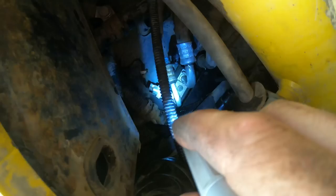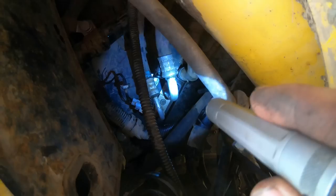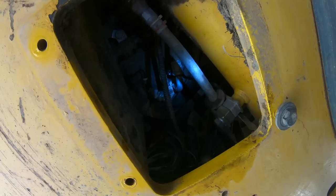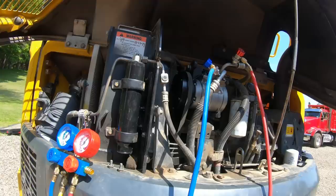That's the evaporator up in there — there are two lines and it's got an electronic going to it, one line for reading. That's probably why my AC kept shutting off and throwing a warning signal, which is actually good — Komatsu built that in so you don't burn the pump out. This was a skid plate I had to take out and you could reach up in there; they made it accessible but it is difficult. Same in cars — they're on the firewall in a tight spot. Make sure everything is tight before you start drawing it down, otherwise you're wasting your time.